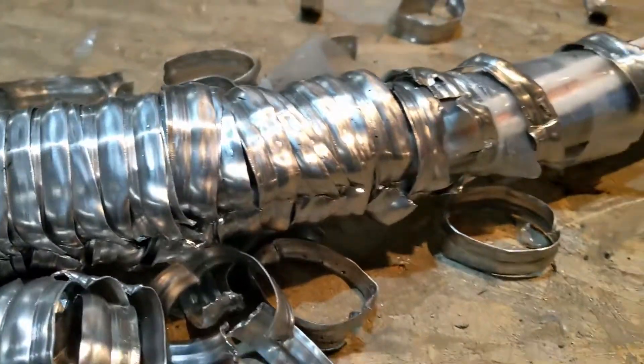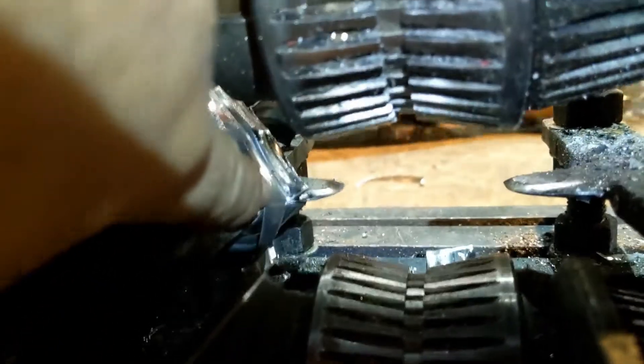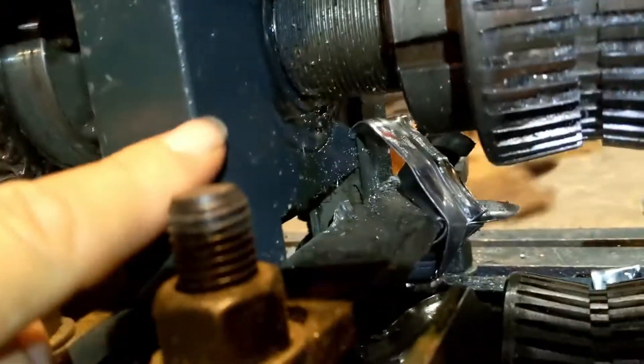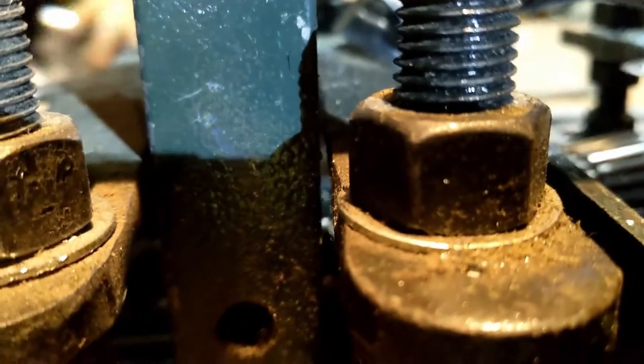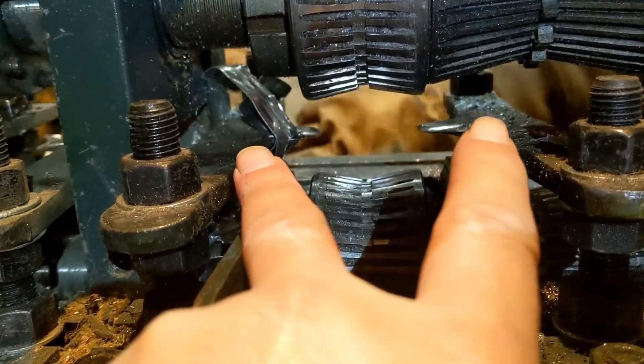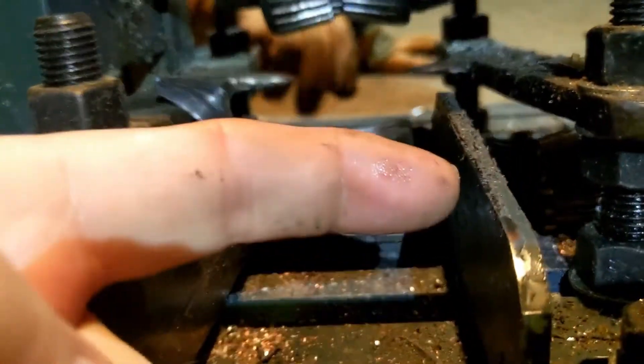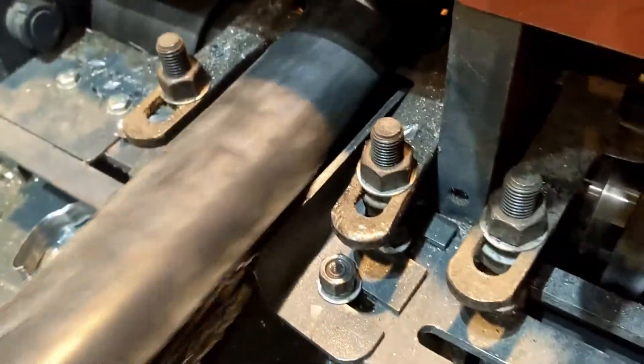So I'm going to try and adjust a little more. What's happening is this is just not wide enough for a two and a quarter, two and a half inch piece. So I can't get this blade far enough over. I've widened out the back so we're pinching then opening it up — these two front guides are closer together than the back two. I'm going to try and widen this out a little more and scoop my guides an eighth of an inch because we're getting really close. I put the guides off the front and moved them to the back to try and stabilize it — it's still kind of S-curving.